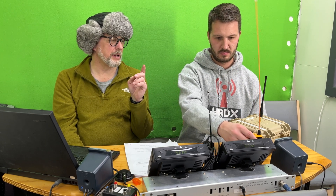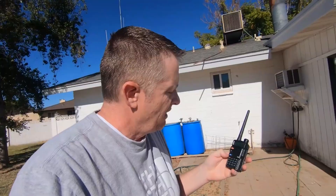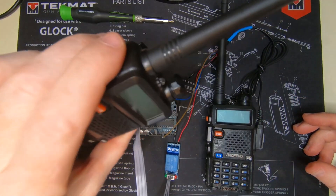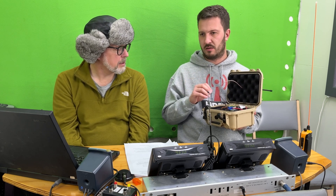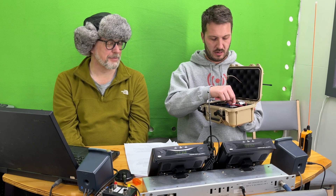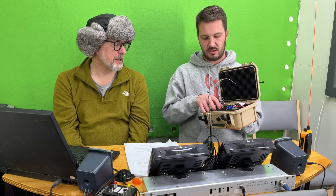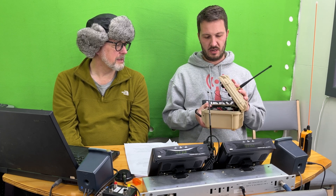The Arduino — did you start from scratch or did you hack code? This is my first Arduino project, believe it or not. I've never dabbled with Arduinos before. The idea of using the Arduino I got from another amateur on YouTube called Charlie, N7JV — he is Red Summit RF. He did a video on this and the code comes from a club in Canada. Basically, you can download the code, upload it, change your call sign, change things like the tone of the CW and the speed. You just upload it, build it according to the circuit and away you go. Really easy — a lot easier than building a script in a Raspberry Pi, and didn't take as long. You could use any handheld that you want; I'm just using the Baofeng because that's the one I had at home.